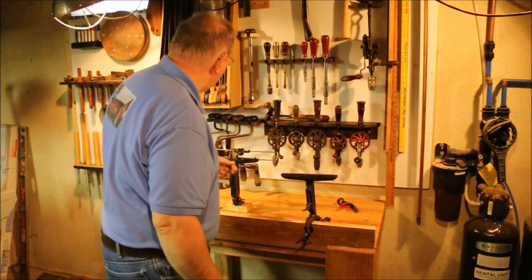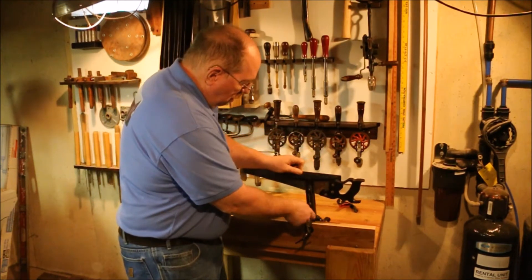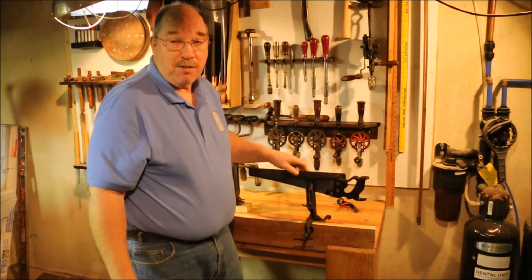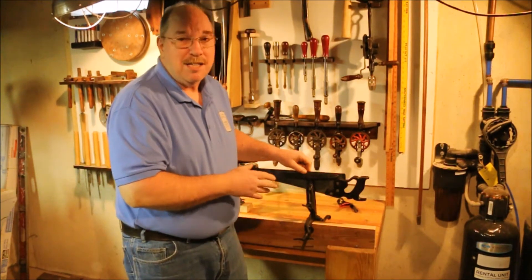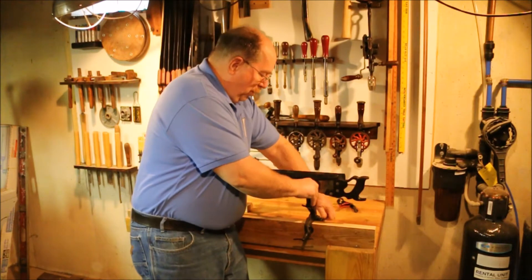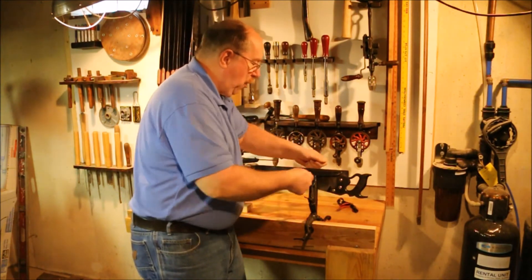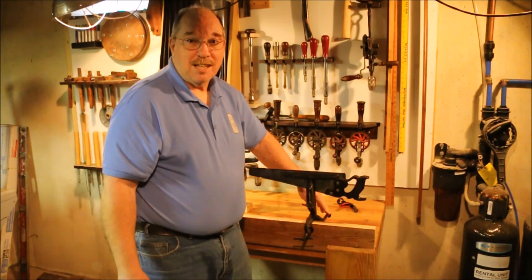This little adjuster here lets you close up the jaws. If you want to follow the crosscut saw with a sloped gullet, which gives it a little more room in the gullet and changes the profile of the tooth a little bit — some people think it cuts better, and I kind of like it myself — you can loosen up this lever and set the saw vise at an angle so that you're filing flat. That makes it easier to hold the file and maintain the angle all the way down the teeth. This long lever lets you adjust it easily.